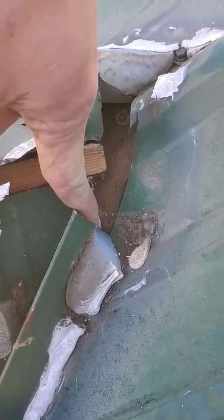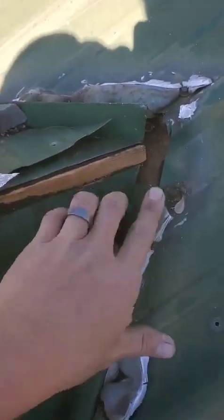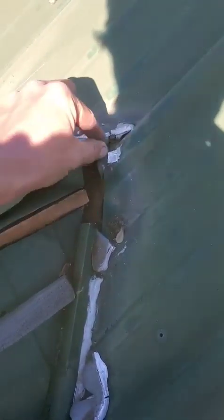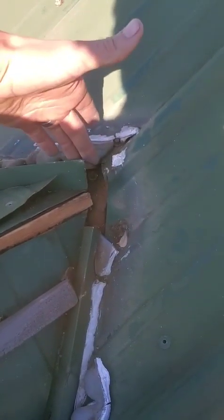If I put this back on like it was before, water is just running right behind there — boom, right underneath the valley. This has been leaking for so long, it's ridiculous. What needs to happen is both of these need to meet up at the top. This piece is gonna come to here and this piece is gonna come to there, they're gonna overlap up above to give you some material, and then the points are gonna meet and you fold one over.